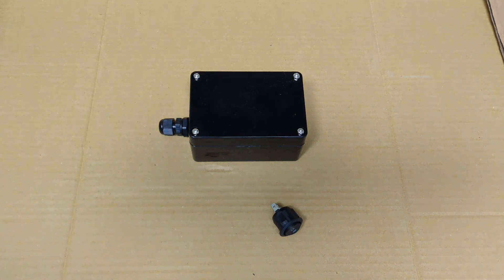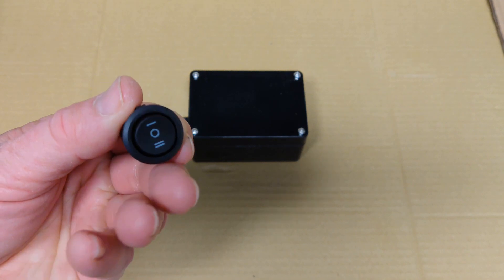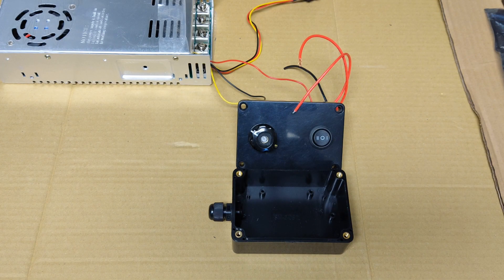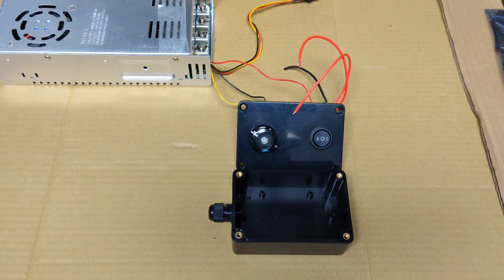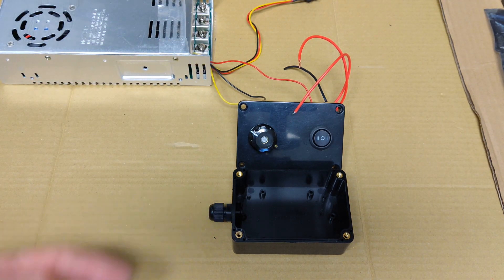This is a little PG-7 gland nut, which I'm going to use to run the cabling through. I'm going to drill a hole and mount it on one side like that. This is the switch I'm going to swap out for the directional one that came with the PWM, because this is marine rated. I'm going to drill holes and install the pot here, and then the new switch there. This is the top of the box — I have the pot here and the new switch with all the wiring. I haven't cut the wiring yet because I want to make sure everything's going to fit. Before you start cutting and splicing these wires to extend them, make sure you run them through any holes or any box that you may be mounting your components in, because if you do it afterwards, it's not going to fit right.